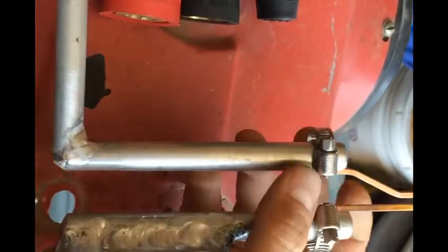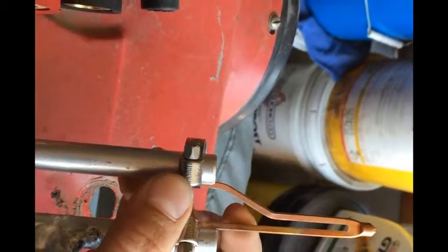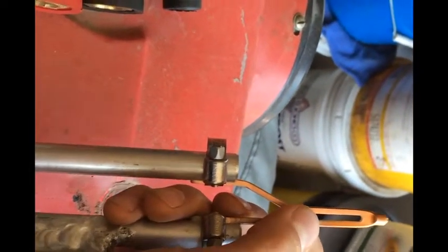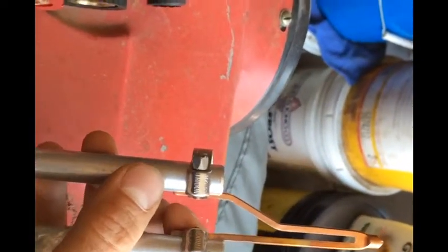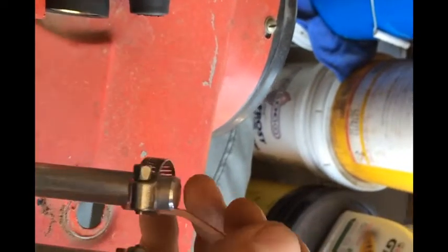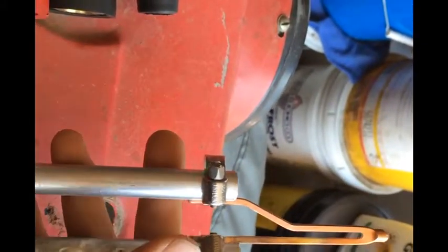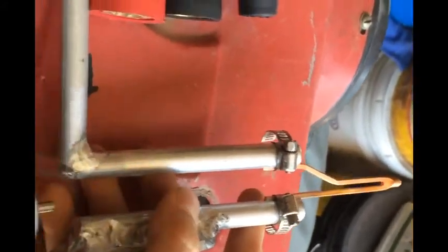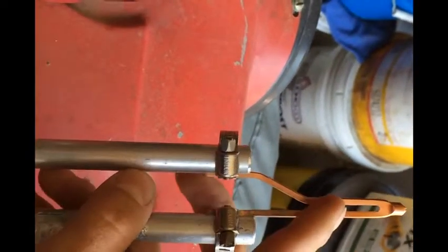But I looked into that and you can't really get thick resistive wire — at least I couldn't find it. I want it heavier duty because I'm building a high-powered soldering iron. Another reason I decided to stick with copper is it conducts a lot better than resistive wire. So if you're trying to transfer heat into a joint, you're going to do a lot better with hot copper than with hot nichrome or kanthal.